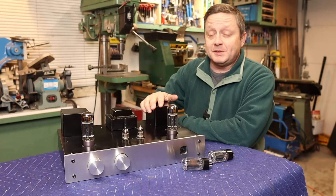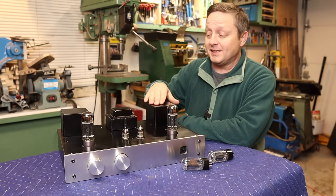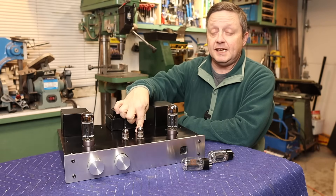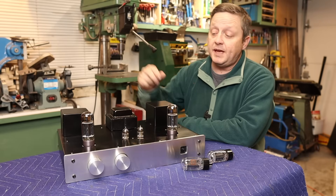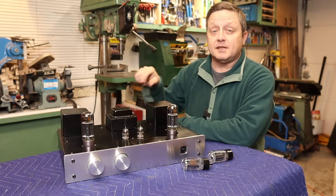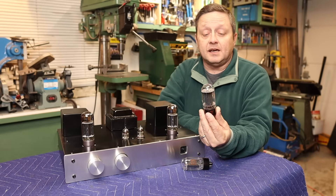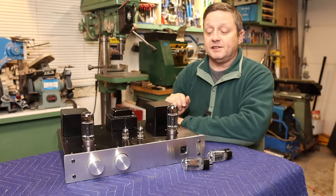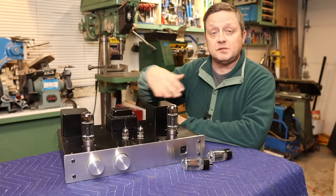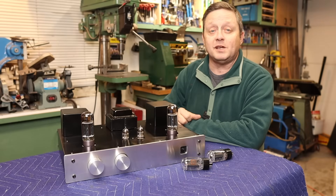I'm really happy with how this amplifier turned out. It was way more work than I thought — it was definitely not done in a weekend. The chassis was quite difficult; I underestimated the thickness of the top plate and if I did it again I'd use 16 gauge steel to keep it straighter. Going forward, I plan to add constant current sources on the 12AU7s and adjust the bias points, and I'll try some negative feedback to see how that alters the sound. As for the PSVane 6L6 tubes, I AB'd them with RCA black plates and really couldn't hear a difference — they sound pretty much identical. Please like and subscribe to follow the future mods, and leave questions in the comments.